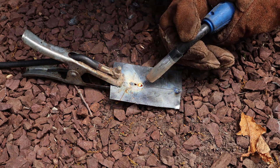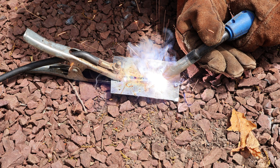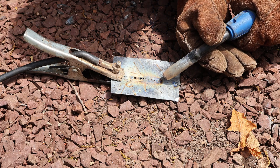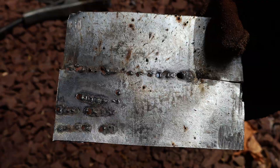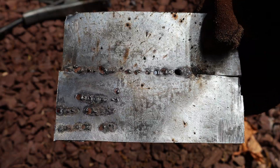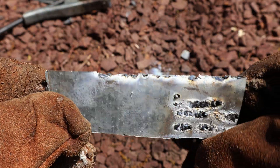In this case, the best technique would be to use a TIG welder, which doesn't rely on wire being melted. Instead, it melts the metal itself and you can then add the wire. But it is also way harder to learn and requires a shielding gas tank, which makes it less portable. If I apply some force, we can see that it does in fact bend, but not on the actual welds, which means that they came out solid.